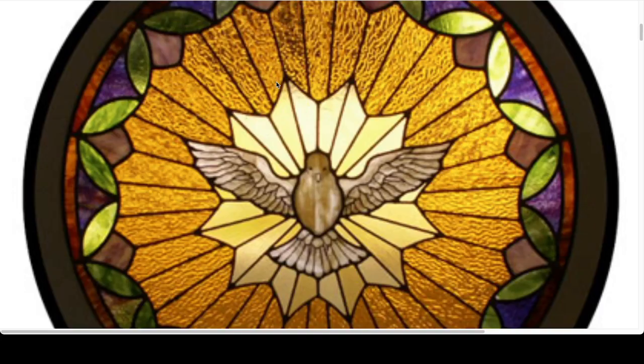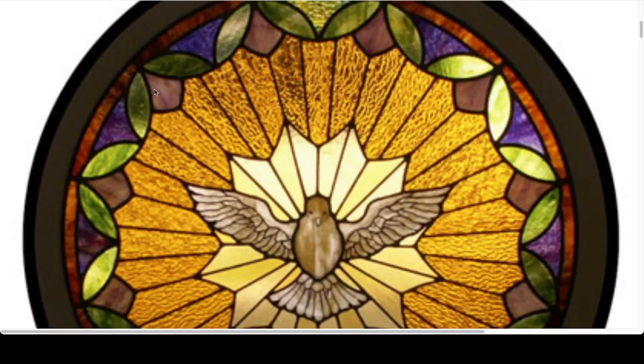And again, it has higher levels of antimony, which will strengthen the actual lead itself to a point where, if you take a curved section like this, which is one piece, it's very hard to bend. You're almost not able to bend it by hand. You have to grab the end with your lead dikes and curve it, putting it on top of your working cartoon to get the shape. And the end result is the lead becomes very sturdy in the window.